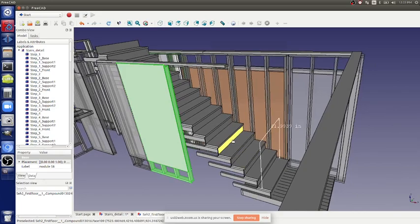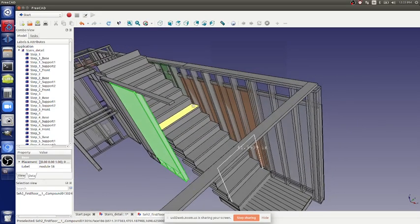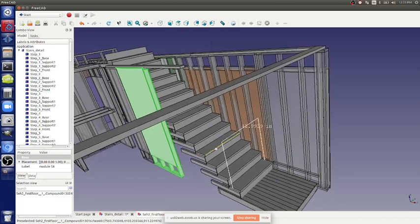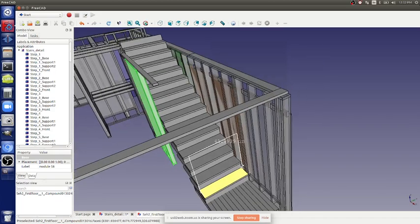What we should probably do is take the 2x12s out there and cut on site, because that will be determined exactly by how much spacing we end up with. The CAD says like 42, but it depends how accurate people were. So we probably should just measure it and cut it. You could have a tiny gap, but it should fit pretty much right in. So cut it to a pretty exact space.